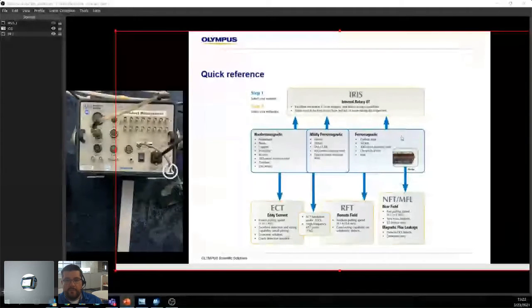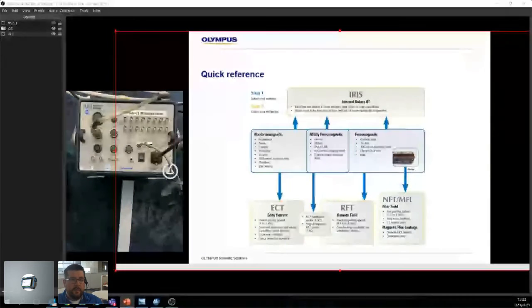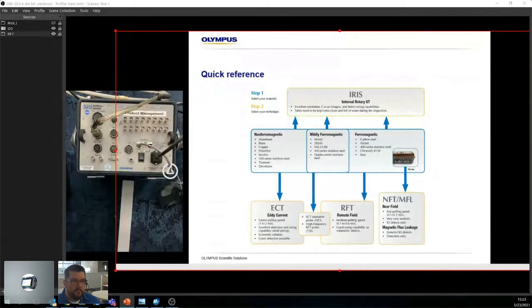And I've mentioned a lot of fins on ferromagnetic materials, but sometimes you'll have fins on copper, right? Well, that works too. You can use TEC probes or EC probes on anything that has fins. Depending on what you're trying to find, you can use a standard bobbin probe, or you can get the specialized TEC probe, which actually has pancakes, which helps you detect circumferential defects, right? So once you have this in mind, it really helps to figure out, all right, what's the next step?